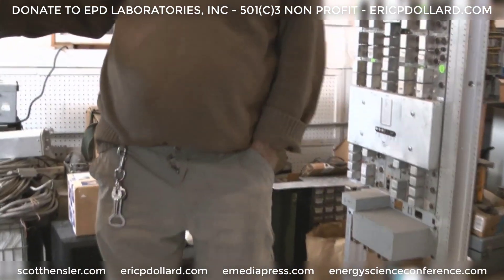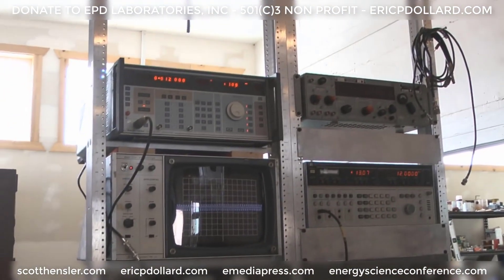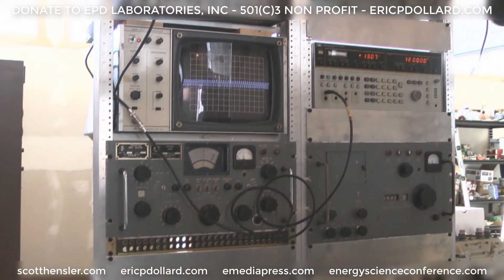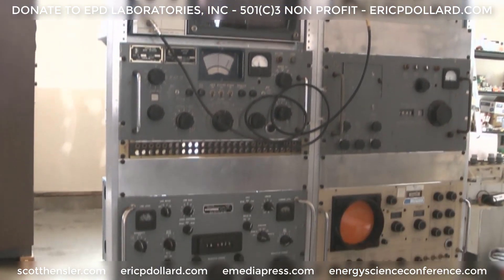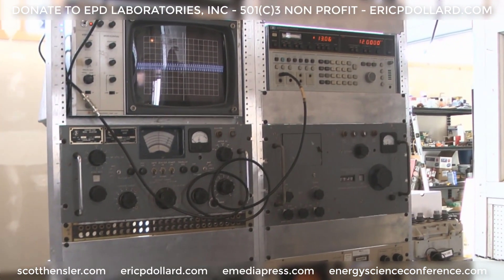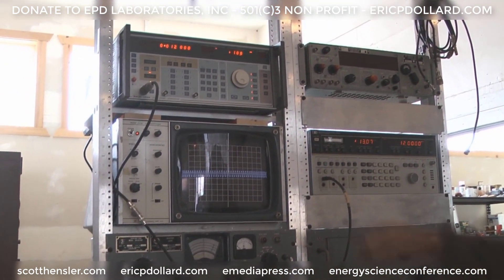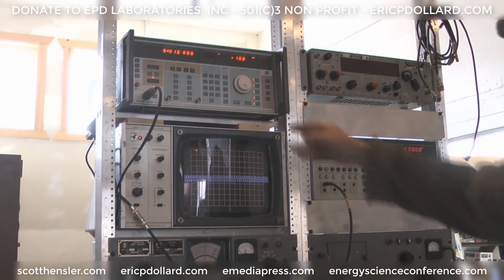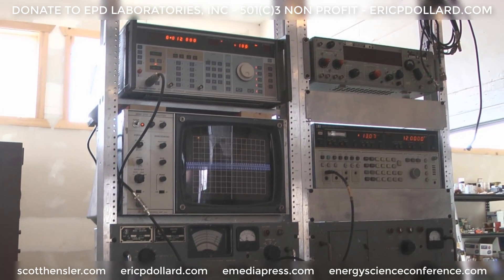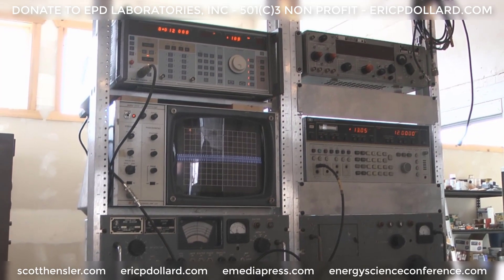Here's the test equipment for monitoring those carriers and modulation, and also the HF ionospheric equipment. This is the search receiver, and this is the modulator for the transmitter, the master oscillator for the transmitter, and the master oscillator frequency counter. And then this is the frequency standard that's accurate to about eight decimal places, so that establishes the basic transmitting carrier frequency that goes out on the air.